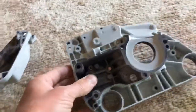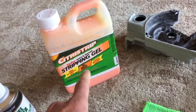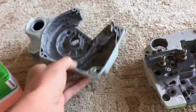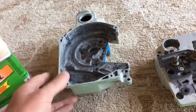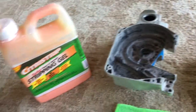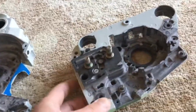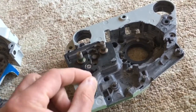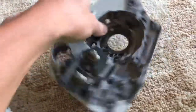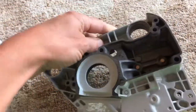Here's what I'll say about this organic stripper — it's a great stripper for paint, but you need to do about three coats. I spent a lot of time stripping the paint off these housings. I painted it on, let them sit overnight in the sink, and that got a lot of the paint off. I had to repeat that process three or four times, then took a little needle and chipped away the remaining paint. It was a long process, but I finally got the housings down to where I felt I could paint them.